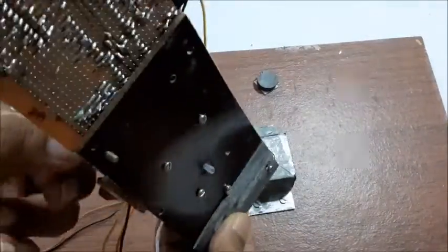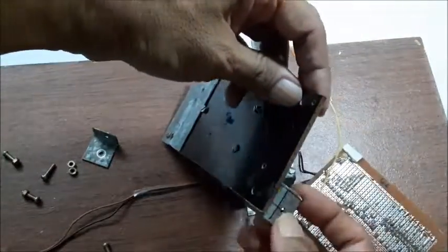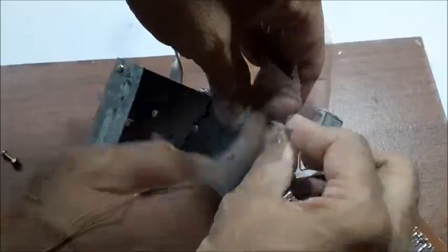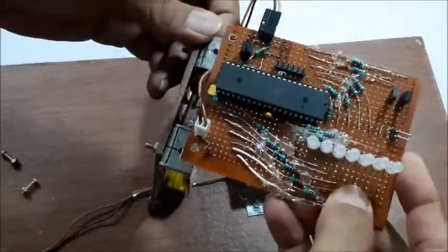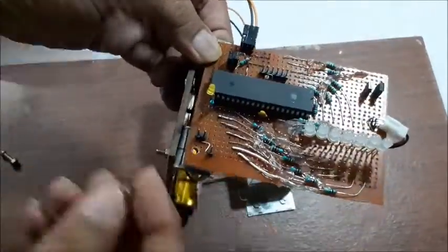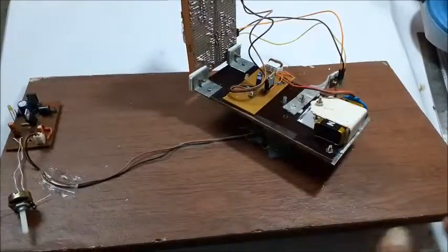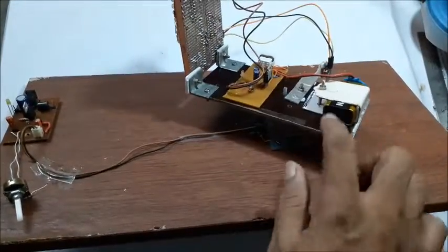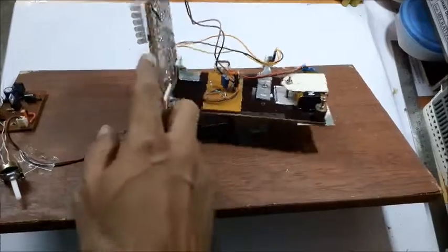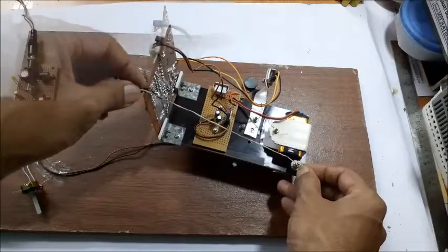Open the screws to dismantle the main board from the hardboard. Carefully separate them without disturbing the connections. Then use 90 degree angle brackets to fix the main board perpendicular to the hardboard using small screws and nuts. Place the assembly back on the motor shaft, check for weight balancing, and adjust the counterweights as required. Tie wire is used to avoid damage due to centrifugal force during rotation.